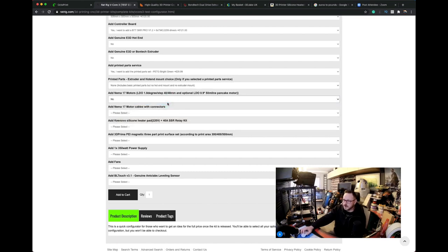No, because I don't know what I want. Do I want stepper motors? No, because if you've already got a 3D printer that you want to upgrade and get rid of the parts, or, you know, if you've got a CR10 at the moment and you want to use the motors off of that, as long as they're not too old and decrepit and the machine hasn't just literally been thrown out of a window, I think you may get away with using some of those steppers.